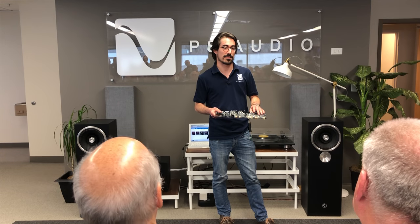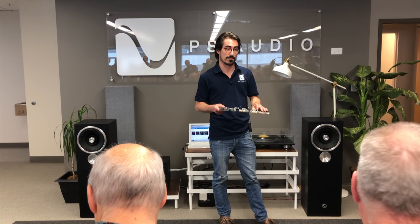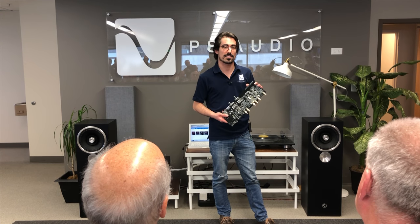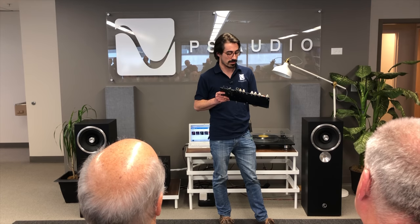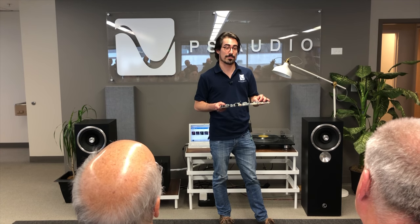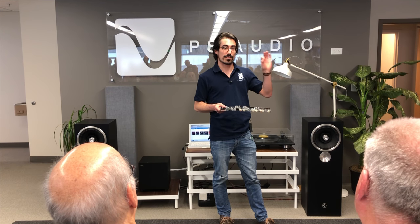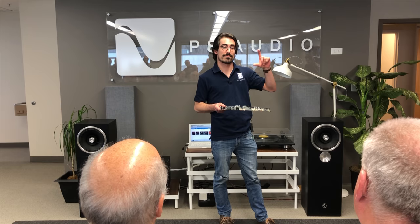But the thing about polymers is that they're generally really low voltage and pretty low capacitance as well. But with that, you get the low ESR and the low inductance. For switch mode applications and high frequency applications, that's big. But believe it or not, and I did a lot of work at B&W on this, we preferred higher ESR caps on power supply decoupling. I'm seeing some eyebrows go up. Yeah, it's a thing. You don't want zero source impedance on a power supply in audio all the time. You will actually want some dampening.